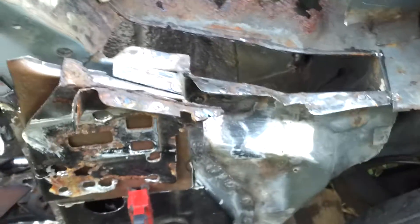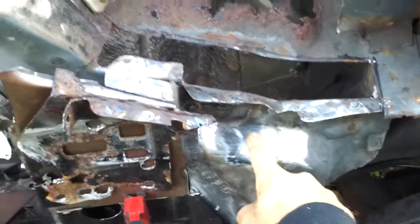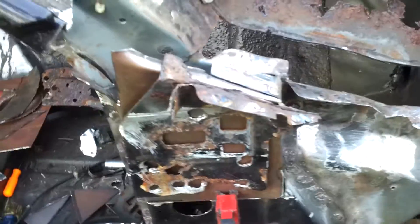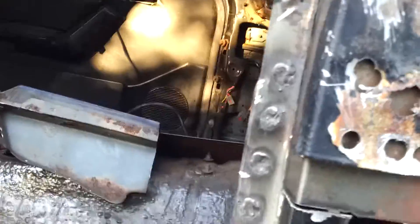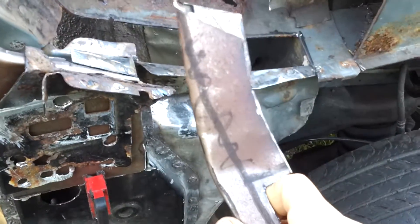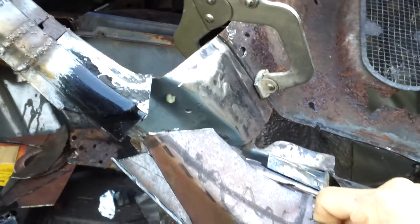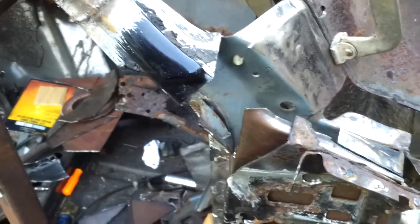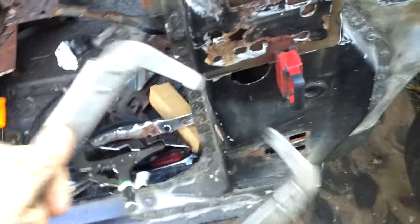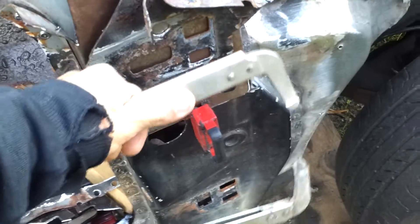It's getting there. At this top corner I cut off, because on the parts car for this inner sheet it was all rusted away, so I just welded in another piece from the original section that was there. For the outside, I just kind of whipped up this piece and then I can just trim it down because it's supposed to go in there. Some of the useful tools — you're going to need the body clamps to hold the panels together. You're going to need the long-style reach ones because these can reach back in there and hold the outside to the inside, and then you can just work it down as you do the plug welds.